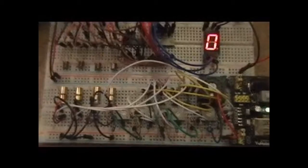And what I'll do is show you the schematic for it here, in case you're interested in doing something like this. As we look at the schematic, you'll see near the top, I've got the current sources. Basically some simple PNP transistors. They use a couple of diode drops to bias the base down below. And besides the 22 ohm resistor, I have a 100 ohm potentiometer in there that I can use to control the current itself, how much of it is going through, and therefore how bright the laser will be.